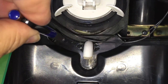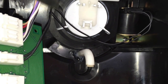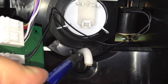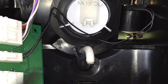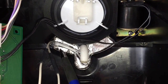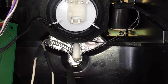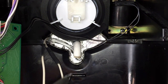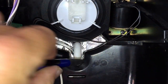Now the foil part of the heater that sticks in this indentation does not actually get hot — just the actual wire does. We put the silicone around the water tube, basically from 12 o'clock all the way around on the other side as well, just to seal this tube from letting air back out. Now we're going to mount the actual heater in this recess area. We have the heater mounted in the recess. We push it in and push it all down with a pencil eraser, and I'm going to take a little more silicone and seal the edges so it doesn't pop out.